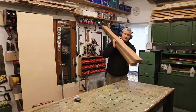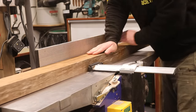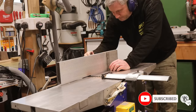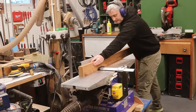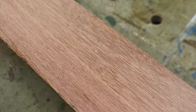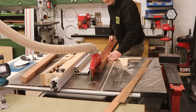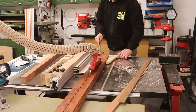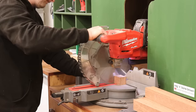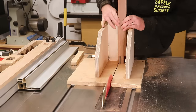With the carcass done I'm moving on to making the leg frames and I'll be using some salvaged hardwood for this which is all twisted and warped, so I first need to mill it up to get it straightened out. This wood has evidence of woodworm which I don't believe is still active, but I treated it with a few coats of woodworm killer just to be on the safe side. The leg frames are basically the same as the ones I made for my desk drawer units in a previous video — linked in the description box — so I'm not going to talk through this in too much detail, but I'm cutting bridle joints to join the corners together which I really like the style of and they provide lots of strength.